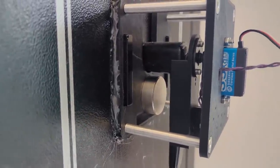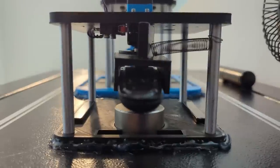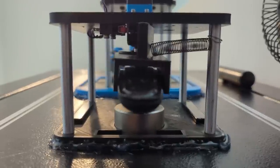Do you remember at the beginning of this video when I said I thought that this project was cursed? Well, let me tell you exactly what happened next. About a week after the live stream finished, I went back to Levi's house to work on the safe cracking robot. Unfortunately, I forgot my 12-volt power supply that I normally use, so I started looking around his house for something to replace it. I found a power supply, and according to the label, it should have worked. So I went ahead and I plugged in the power supply, and I immediately heard a popping noise followed by the smell of smoke. It was clear that I had blown up the microcontroller with the TFT display because it would no longer turn on.